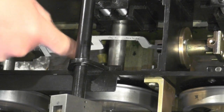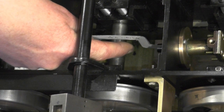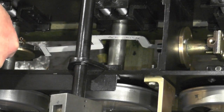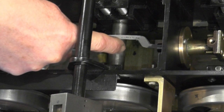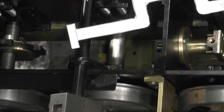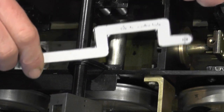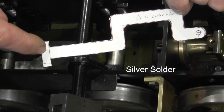So on its minimum stroke, on this side here I've got three-quarter inch clearance. When it gets to its maximum stroke it's going to move over five-eighths, so I've allowed one-eighth of an inch before it hits the axle. I'm going to cut this out in brass — it says make it out of mild steel, but I think I'll use one-eighth brass plate and then braze this end on.